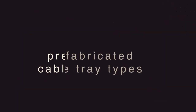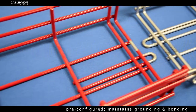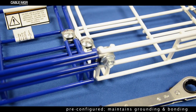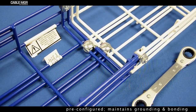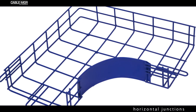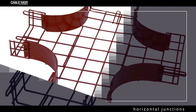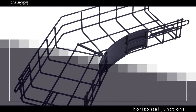To maintain support of cables at changes of elevation or direction of a tray, a large number of specialized cable tray fittings are made compatible with each style and manufacturer. With WireMaid Cable Manager, cutting straight sections to make a directional change are a thing of the past. The accessories are pre-configured to attach to the end of the tray to save time and labor, while still maintaining grounding and bonding in the CM20 tray. Horizontal junctions change direction of a tray in the same plane as the bottom of the tray and are made in 30 degree, 45, and 90 degree angles. These come in various shapes, including T's and crosses.